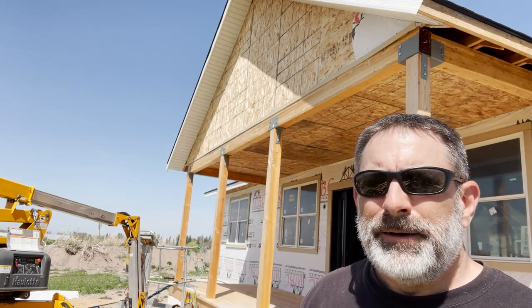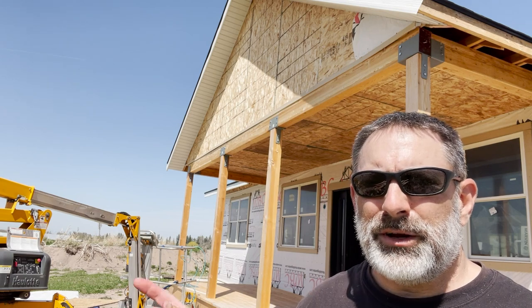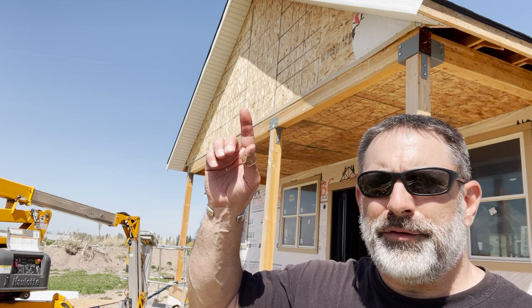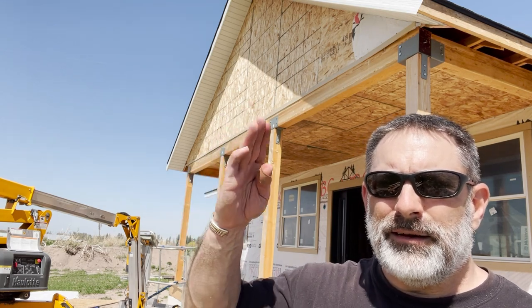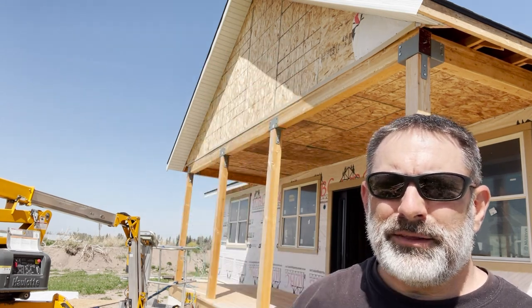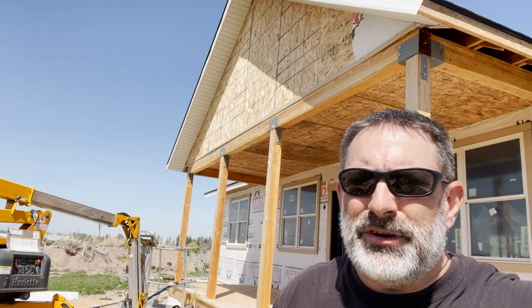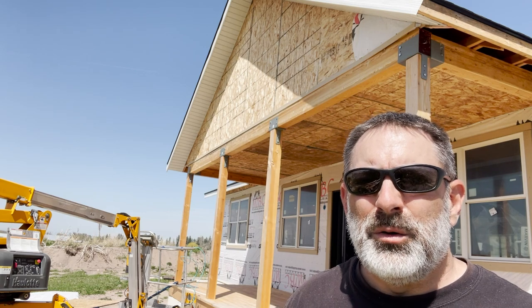the side here. The other thing that we're doing is we're going to do one 18-foot, a 12-foot, an 8-foot, and then a 4-foot, so that we get a mixed seam throughout instead of having one single seam. It'll give us a better look. We did that on the shop, and I like the look of it, so we'll get busy doing this here.